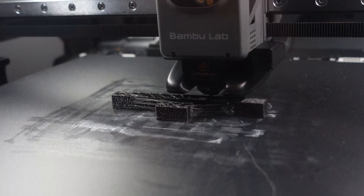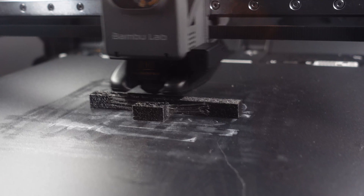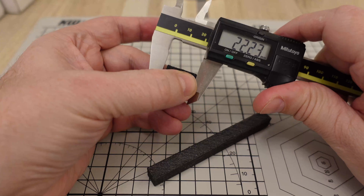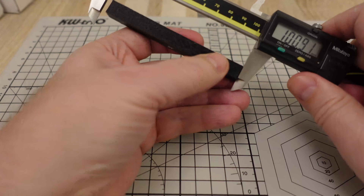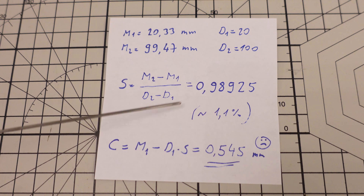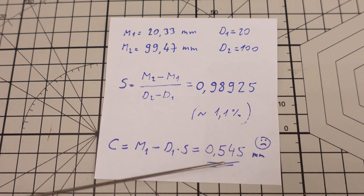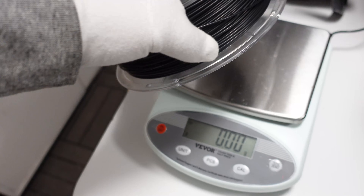Two test parts for measuring. I hope you can see the stringing — it's clearly a problem. This part should be 20 millimeters; measured: 20.33. The 100 millimeter part measured: 99.47. Calculating the scale factor S — in this case shrinkage is approximately 1.1%. More importantly, the constant offset C is calculated using its equation, and the result is huge: 0.545 millimeters. If the filament is dried, this number should be much closer to zero. Now let's try to dry it.